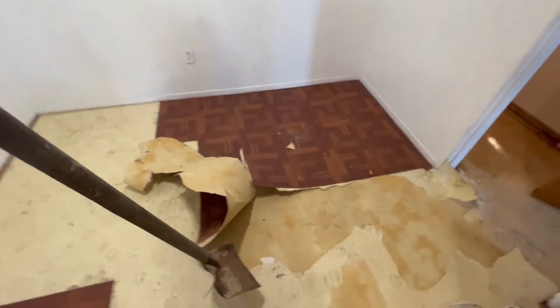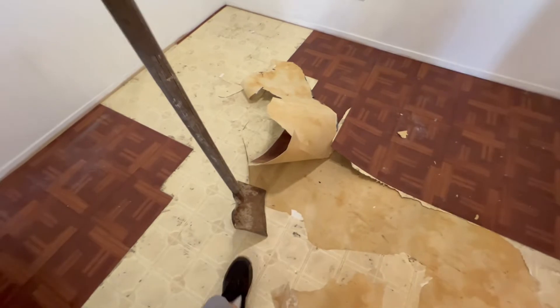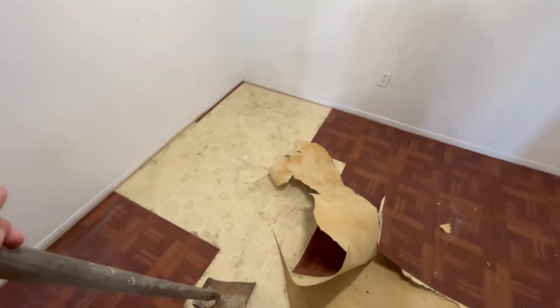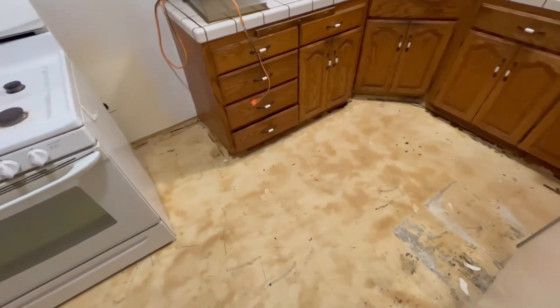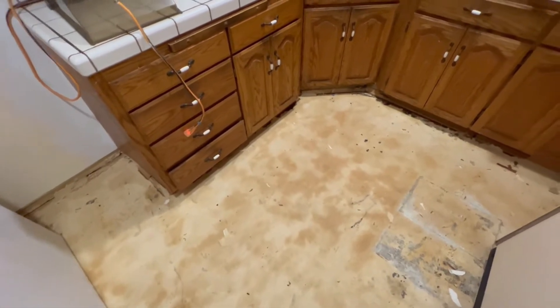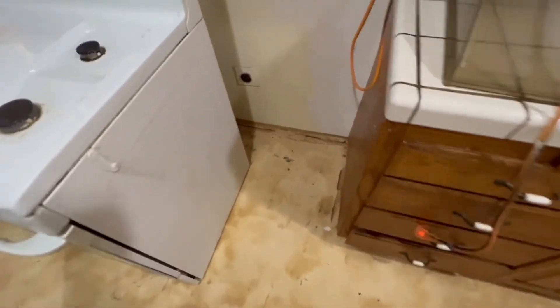If you have like heavy tile, then you're going to need the heavy-duty scraper so you don't chip your shovel. But this is just a shovel — see how much I could get up. Here's what the floor looks like once it was all scraped up. As you can see, there's still some paper residue left over. That might have to get sanded off — there's paper still, but all the actual linoleum scraped up fine.